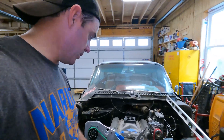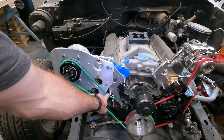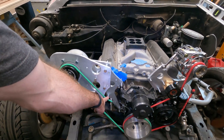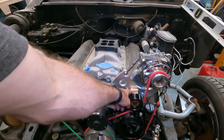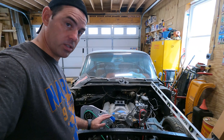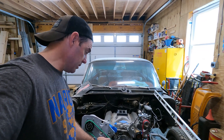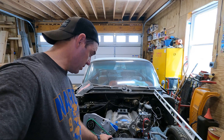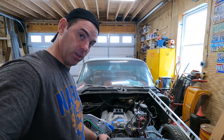The other items that require a little more detail are the tensioner that will push this down to make the belt tight, and the idler pulley here — that standoff needs to be machined. That's how you make a whole custom aluminum accessory drive set for a small block Chevy. This is the second time I've done this, and I'm sure there's more I could change, but this is going to stay the way it is for now. This is David Hill with SolidFixBuild — thanks for watching.